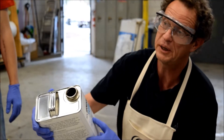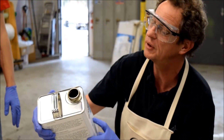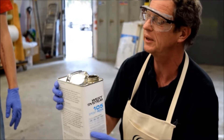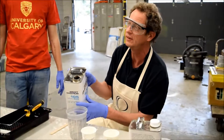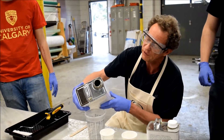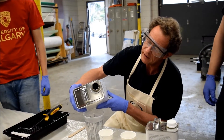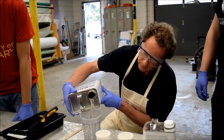You'll notice it appears as if I'm trying to pour out of this can backwards. The reason you do that is because if I pour it the normal way, it immediately dribbles to pour. If I turn it this way, I've got a larger air pocket with the fuller can — theoretically I should be able to tip it and pour it nicely.